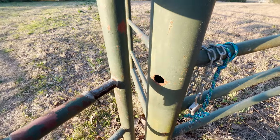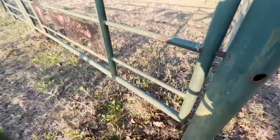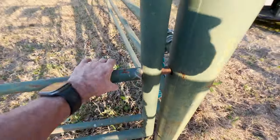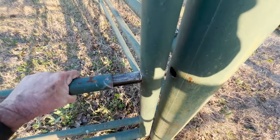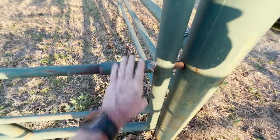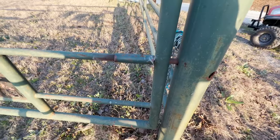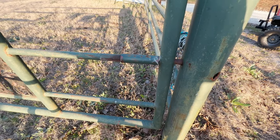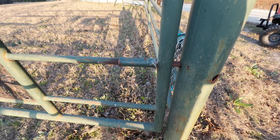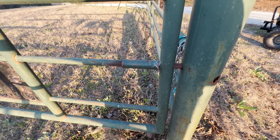That's why I keep a rope and chain here to lock the gate if I need to when cattle are close — a three-way security system. These things get a little sticky, so you've got to keep them lubed up. I use a silicone-type lube that comes in a spray can, though WD-40 or anything along that line works well too.